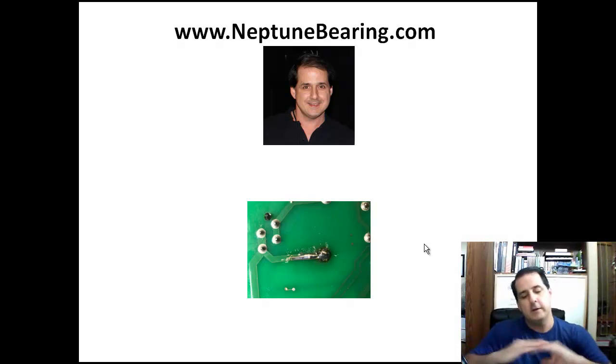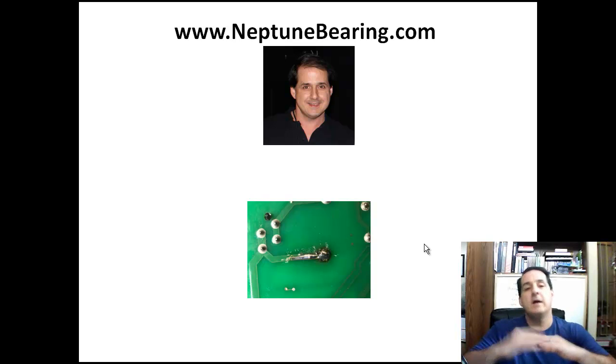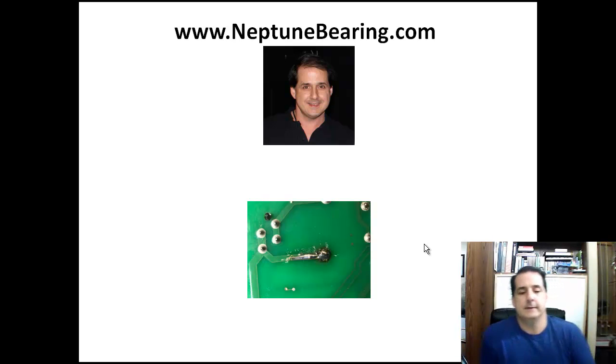And whenever you have pitting on contacts, that makes resistance. Resistance resists electricity. So what happens is you run electricity through it, it gets hot, and it turns into like a resistor. So eventually the contacts get so hot, the heat transfers down to that board connection where the solder is and just goes.